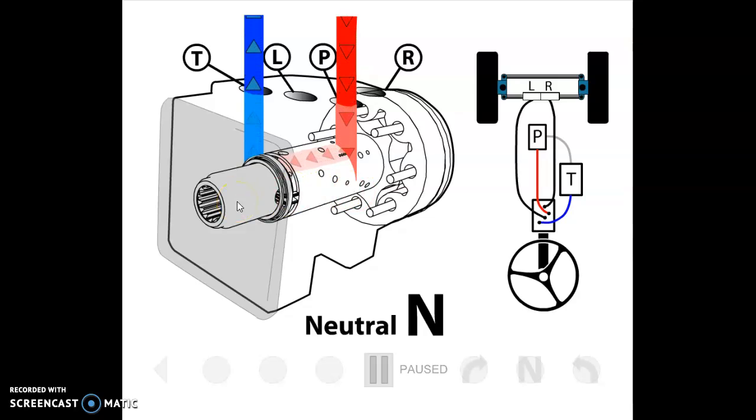What's interesting about this type of steering is it feels very automotive, but it obviously isn't. Regardless of where you stop the steering wheel, the centering leaf springs will recenter the spool in the sleeve. That stops flow from the pump from going to either steering port, the work ports become blocked, and that holds the steering wheels at whatever angle they're at. This is not like automotive steering — taking your hand off the wheel won't direct it back to a straight-line position like caster and camber do in automotive or truck steering. This doesn't have a return function; it's going to stop wherever you stop.